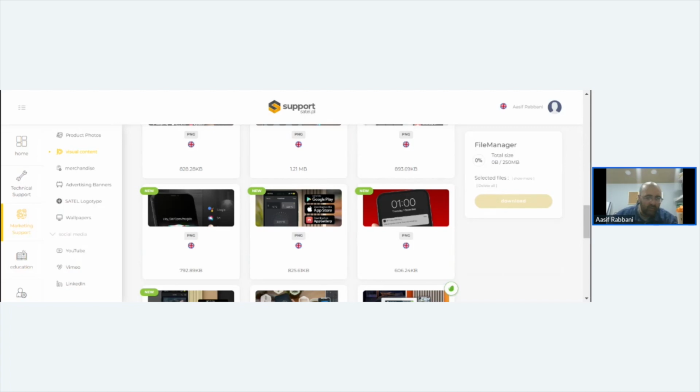What's the range like between multiple outbuildings? On the Perfecta, it's got a 100-meter range. If you wanted something that's going to go further, then obviously in that 100 meters it all depends on the fabric of the building. If you wanted a longer and bigger range, you'd go Integra and use ABAX, or you could actually use ABAX and Perfecta together. But you'd be looking at a much more advanced system, because ABAX has a 2,000-meter range and it's quite powerful, and you can even get little wireless expanders. You can expand 4 wired zones out of a wireless expander, which is really cool.